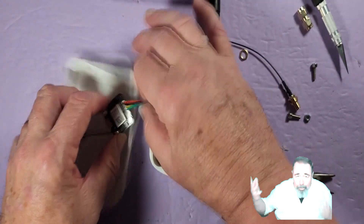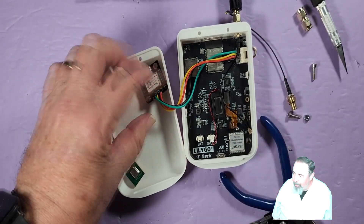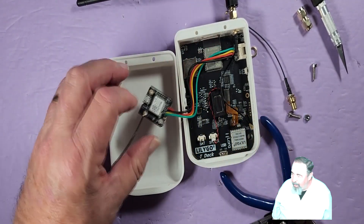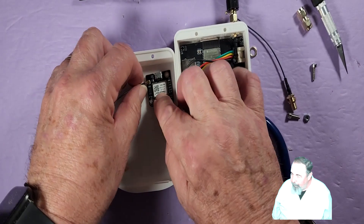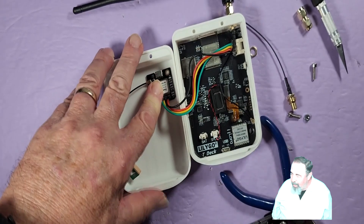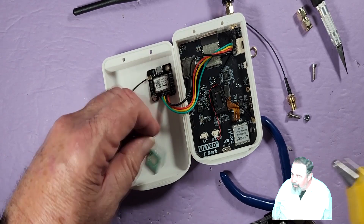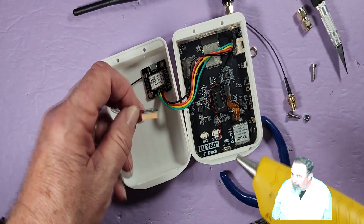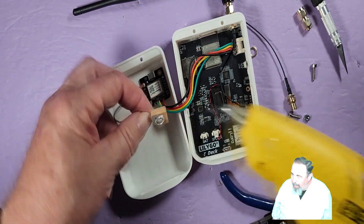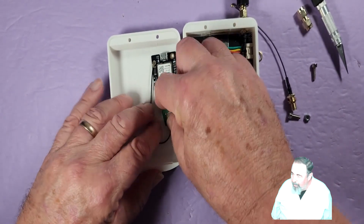Look for the links in the description down below. I get a little dab of hot glue and drop the GPS module in just like that — hold it for a second, and that's stuck. Now let's get the ceramic antenna with a little dab of glue. I don't want the antenna wire in the way of the battery holder, so I'm going to spin it around like this and hold it. There we go.